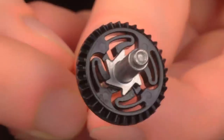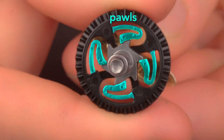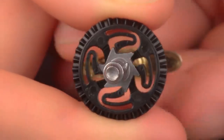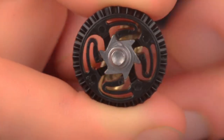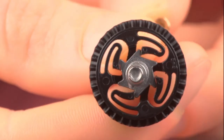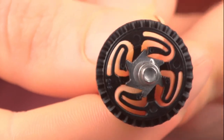The shaft also has an angled six-tooth ratchet gear. This gear fits inside a larger plastic gear. On the inside, there are four flexible pawls, so the axle turns independently from the plastic gear. This happens when the music box is wound. When the spring unwinds, the axle turns in the opposite direction, and the six-tooth gear catches the pawls, which rotates the larger plastic gear with it, driving the music box.